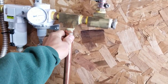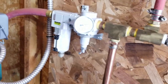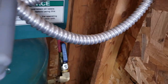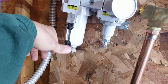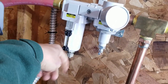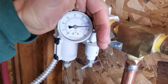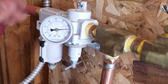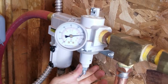I put a tube down here supposed to collect water and blow it out the bottom, but I haven't gotten a drop of water out of there because I have this regulator on here. Three-quarter inch pipe comes up, three-quarter inch ball valve, comes up here — got a 90 right there so there's no kink. It's got a filter in here that collects the water, and it's got a little sight glass on it. I'll put links in the description if y'all want to get one off Amazon. You can loosen this and it'll blow the moisture out the bottom. The only problem I've had is this regulator — it's got this hole right here and it weeps air out. I've taken it apart and looked at the diaphragm, but it can weep air and it's kind of annoying. I just play with the pressure and get it set right where I want it.